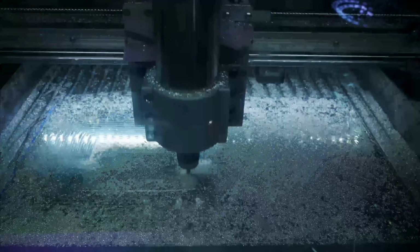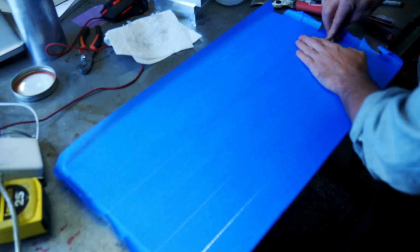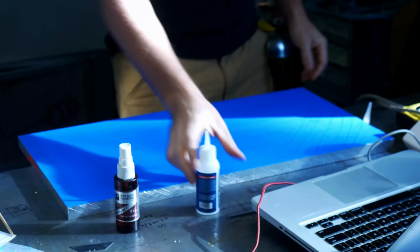Burnishing again here. That burnishing tool, I was really careful to chamfer it and make sure there was no sharp edge, so that the corners on that are kind of rounded and I can't accidentally gouge up the tape and make a raised portion. It's just made out of a piece of half inch round stock, a piece of steel.